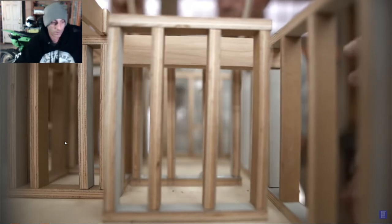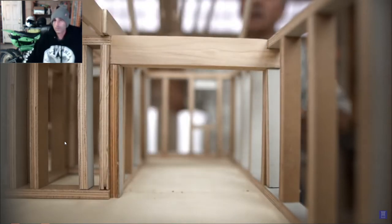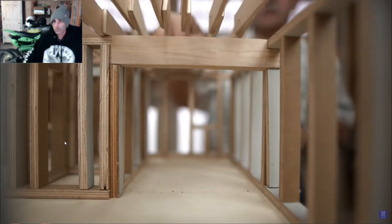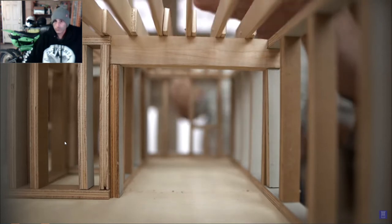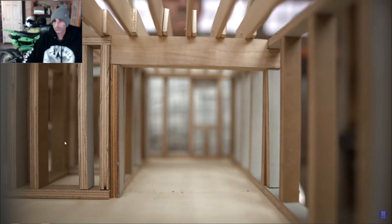And with that in place, can we take our temporary walls out? Take the temporary walls out. This guy comes out. Our floor above has never left us. It's still there. And now if we were to push down on this, it's going nowhere. And as I look into this room, it's a big, wide, clear span, but I do see the beam hanging down. So I've got to live with that header there.